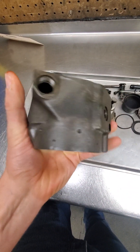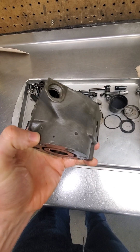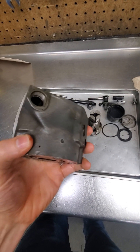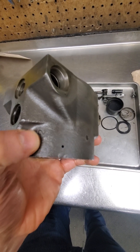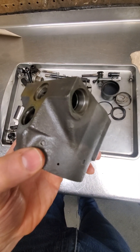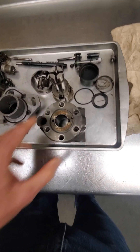These things were made with these plugs. This is a six-cylinder — it was on a 4020 — so there are six sets of those plugs in there. There's a lower plug and an upper plug, and they will leak out of those. There's supposed to be an epoxy on top of them, and I can tell this one's pretty old because the epoxy has fallen off. So we drill those plugs out, put new plugs in, and you have to use a special epoxy to keep them from leaking.